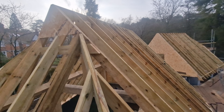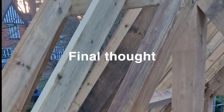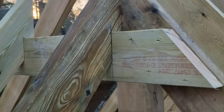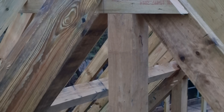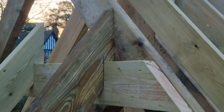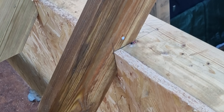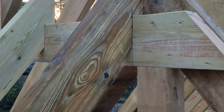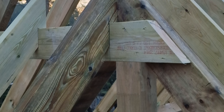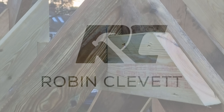That one is exactly the same as this one, just an opposite. This is the gablet, that's the barn end, and the gable. Lean-to roofs — a lean-to roof is a single rafter which might lean against the building, often back extensions. A lot of people build lean-tos and don't do it correctly. What you should have is a pole plate, and that should be bird's mouthed over — that gives you all the strength. All the tiles on the roof will just want to slip off the wall plate, but it'll be just as strong without any fixings because it's hooked over that plate at the top. A lot of architects and engineers insist on that detail.